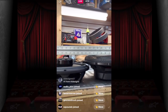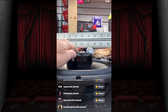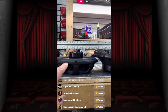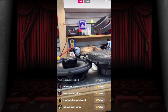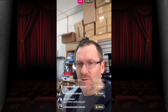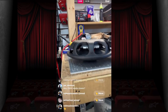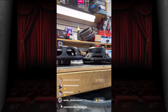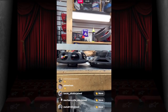The Arc magnet is not a hindrance — it's actually working out well. If you're down-firing this, the magnet side can be the floor, and there's still way more usable depth from this woofer than the conventional one. Airspace on this is minimal — optimum is about 1.1 cubic feet, can go as low as 0.8.